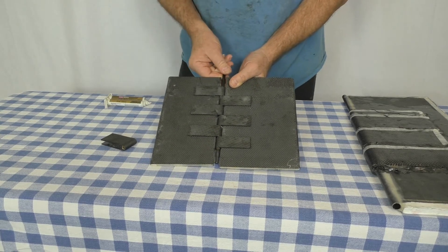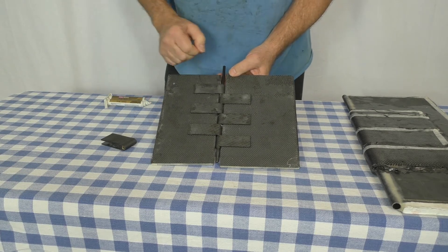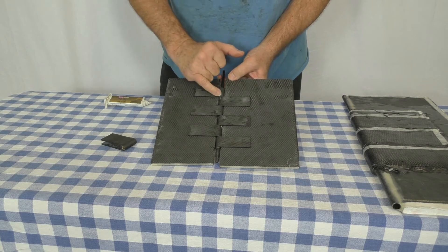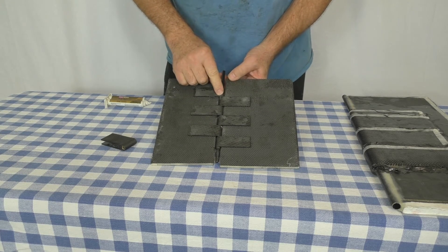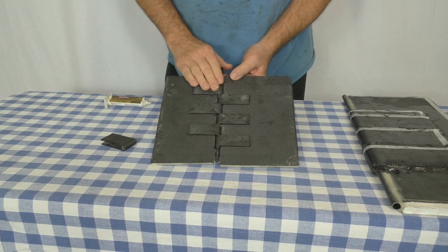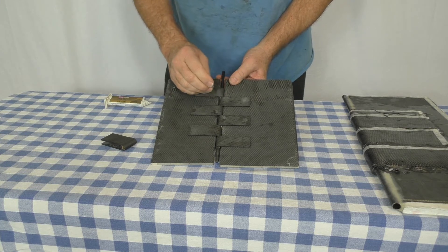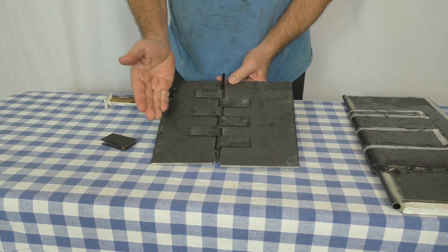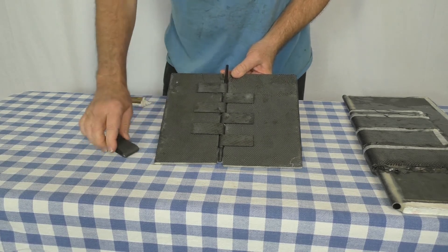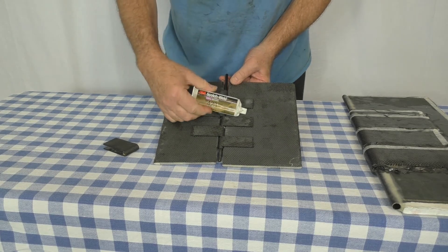It's not too snug of a fit and then the pin goes in this way. There'd be four of these panels, as discussed in the other video. I did some analysis and found that you can leave gaps up to 25, 30, 40 thousandths of an inch between the lugs before you start putting too much load into the pin. So you can leave a little bit of gap and make it easy to slide the parts together where alignment is not a huge issue.